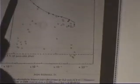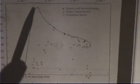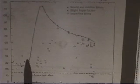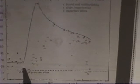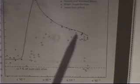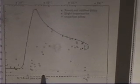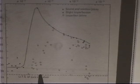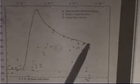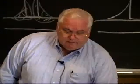And you can clearly see a dependence on the joint thickness. The thicker the joint, the weaker the joint, until you get thin enough, and basically here, you don't get a complete joint. You have lots of voids, so the thing falls apart when you try to go too thin. But if you can get a good joint at 1/10 of a thousandth thick, you can get extremely high strength. And if you're at 3 or 4 thousandths of an inch thick, then you actually still get 50,000. That's a much better strength than you would expect. So tomorrow we'll talk about why that's so. Okay?